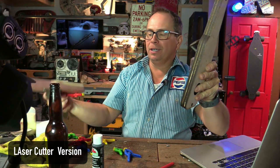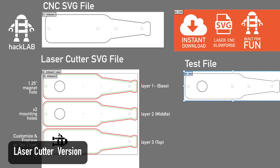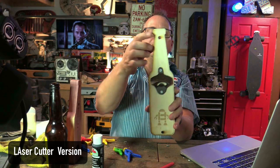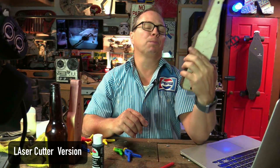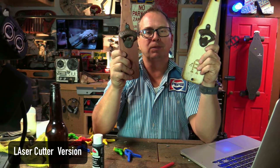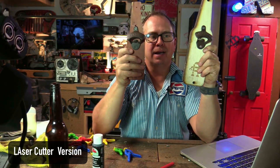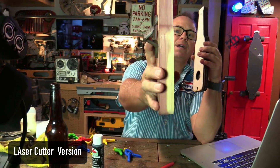In this situation with the cedar, everything's sticking to the magnets. This magnet is one and a quarter inch diameter. On the laser cutter these are sixteenth inch, and the mounting holes for the wall are an eighth inch. I added a cool little profile and I like the burnt edges — I'm going to experiment with different colors, staining, and sanding. As far as the two competing machines go: the CNC has lots of setup — the router bit, setting the depth, leveling the board. There's not much setup with the laser cutter. The post-operation requires gluing three pieces of plywood together for the laser, where you don't have to do that with the CNC.